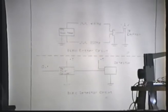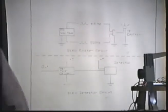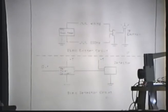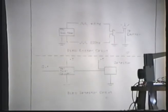So then what we decided to do was to pump up the current coming out of the IR emitter by putting a BJT transistor between these two points here, which now we found works out very well, thanks to a little help from Mr. Schweisguth. And now we are able to get the full distance of the maze. Last night, we were actually able to get a full 63 feet. And now, my other partner, Tom Anderson, will speak about the detector circuit.